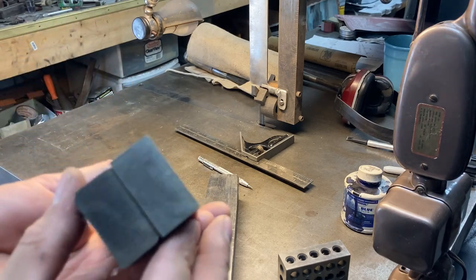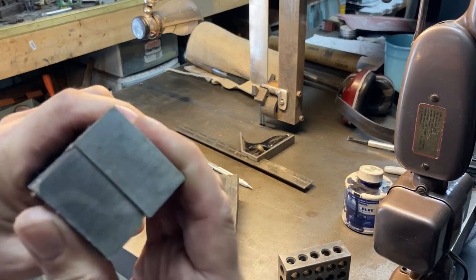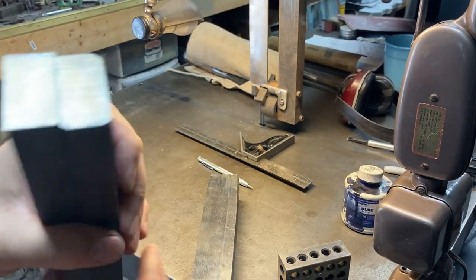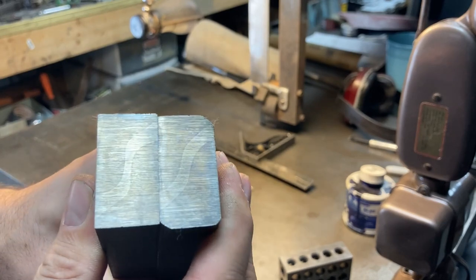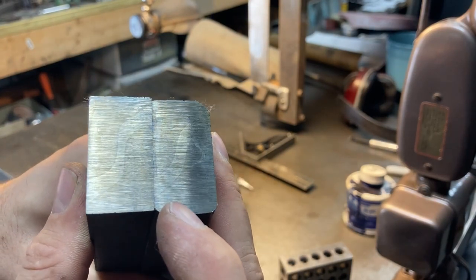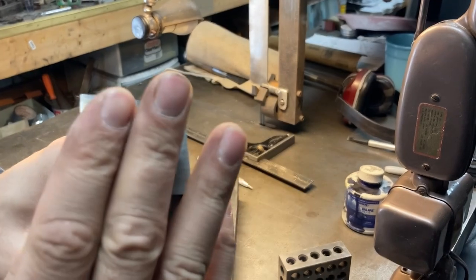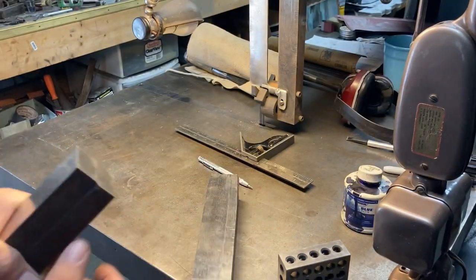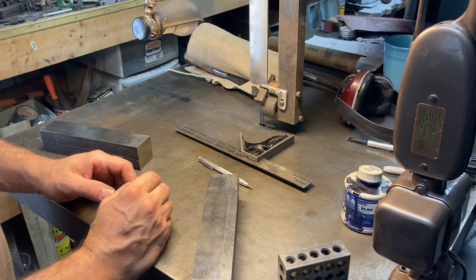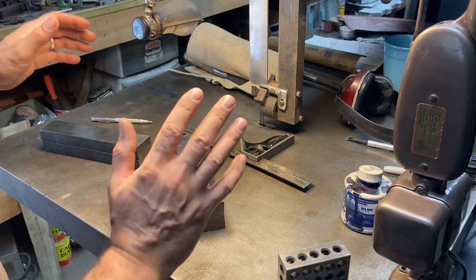This bar's pattern is more spread out and thinner — it didn't upset as much, and it's pretty much off the corner exactly the amount we'd want, which is nice. The cut middles are really nice: pretty horizontal middles. They could be a little more curved at the edges, but it'll look fine in the finished bar, and this gives us plenty of room to rip down the middle and separate it into two very distinct corners. We'll make a chain link out of this bar and out of the other bar. They'll look a bit different from each other, but mixed up into a final pattern of two chains side by side, the variation actually gives it extra life and charm.